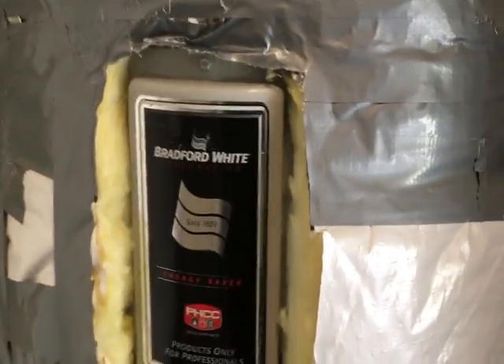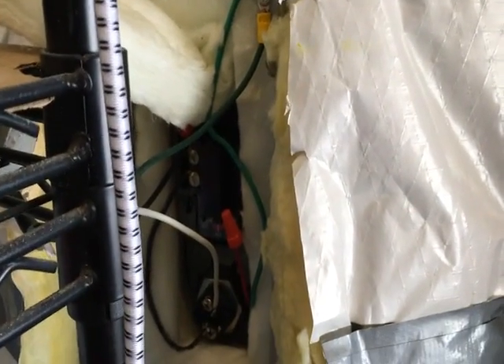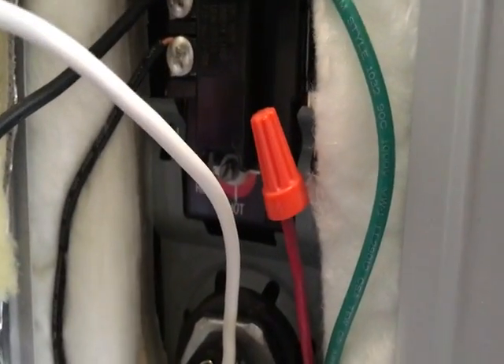The upper element is still tied in, but I've got it turned off at the electric timer and also at the double pole breaker. My hot water tank is being heated by solar. When I turn the breaker back on, the upper element won't have to work as hard — because as Enroj points out, cold water comes down to the bottom of the tank and heat rises to the top. If you heat the bottom, that hot water rises up and you end up with more hot water in the tank.